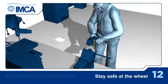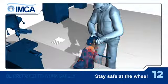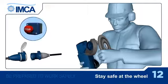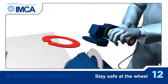Check the direction of the sparks to make sure they're not endangering people or equipment. When you're attaching or changing wheels or discs, always disconnect and isolate the tool from the power source before you start. Don't lay down a tool while the disc or wheel is still spinning.